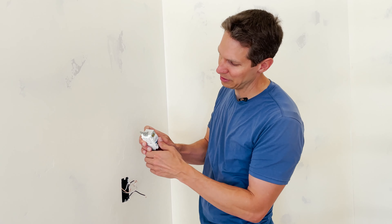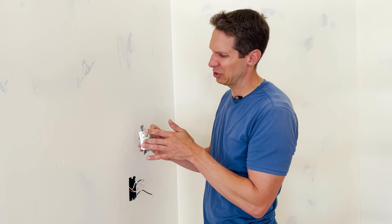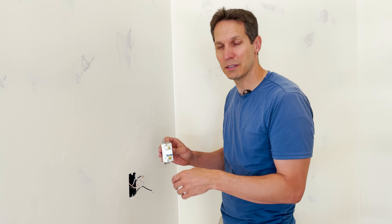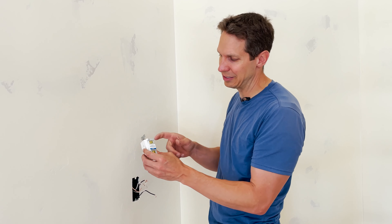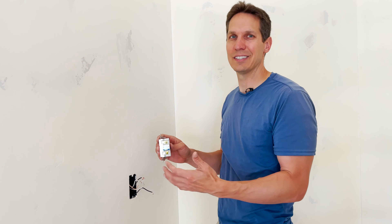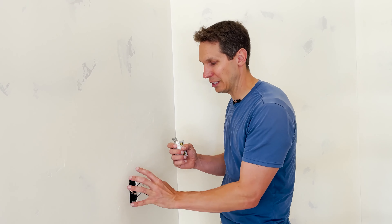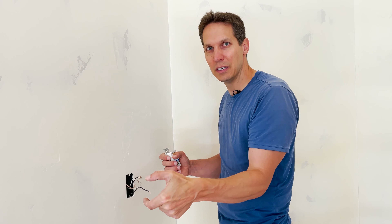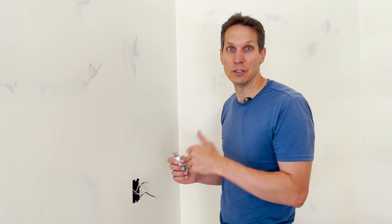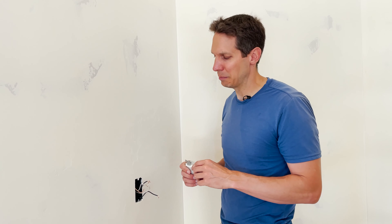I'm not going to physically assemble it here because it's a real pain — you don't want to watch me struggle for 10 or 15 minutes fighting all the extra protection layer on the GFCI. The most important thing is the concept: make sure you have everything in the right spot, at the right location, and that you're protecting everything. There are testers out there for about eight bucks — stick the tester in the outlet down the line, push the button, and if wired properly it will trip the GFCI. Always verify what you've done to make sure you're actually protected.